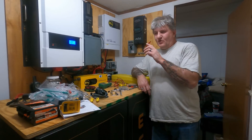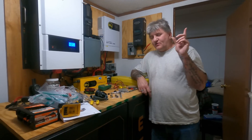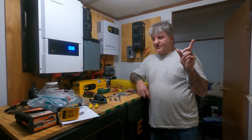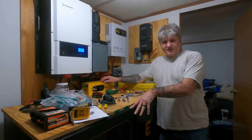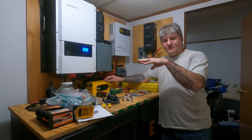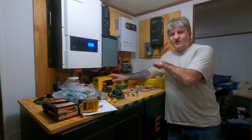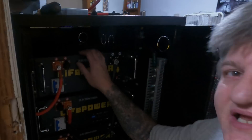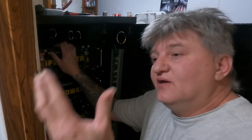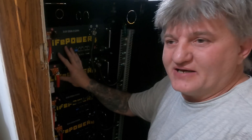I've got all the batteries hooked up. These batteries here are down to 95% right now. The generator is running in the background and the charge inverter is running. So I'm going to top these off to 100%, and then I'll turn the new batteries on. I want everything to be at 100% before they all come online with each other. We'll get these back to 100% and I'll kick all those batteries on. I buy 24 volt batteries simply because we have other 24 volt inverters, so if the 48 volt goes down, we can switch right back to 24. I have the option of going 24 or 48 — that's the reason I'm buying these batteries.